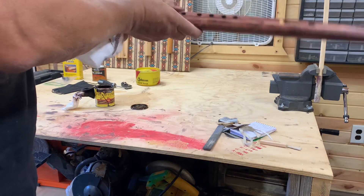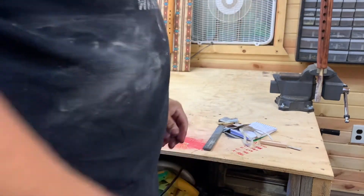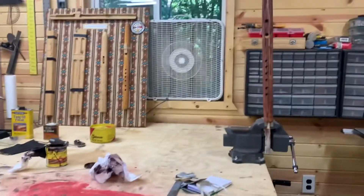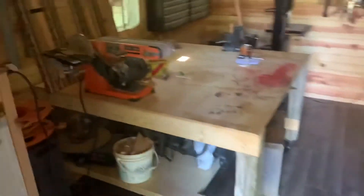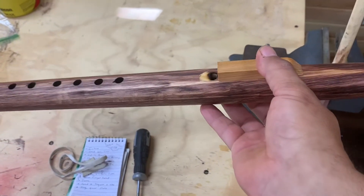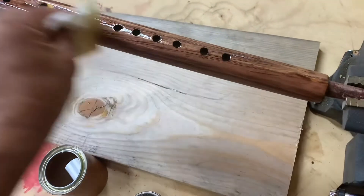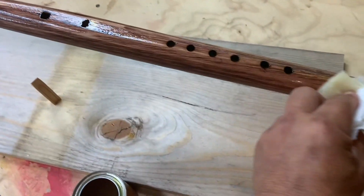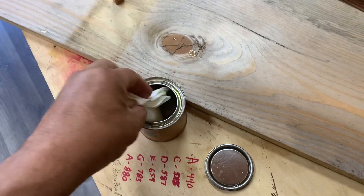I used a darker stain — some type of redwood stain or something of that nature. The next day I went back and, since it had been really hot and humid these last few weeks, I let it dry overnight and applied a second coat after my first cup of coffee in the morning. I let that dry a little bit and then decided to water sand it at 1000 grit and put a third coat of semi-gloss on. I wanted to contrast the bird against the dark wood, and that's what you'll see on the final end of this flute.